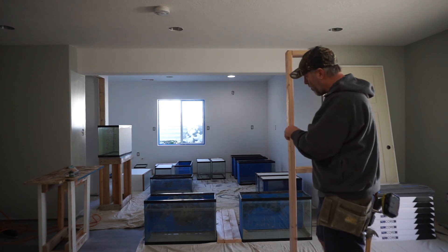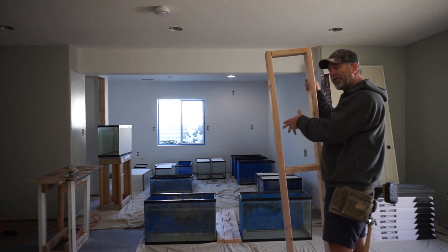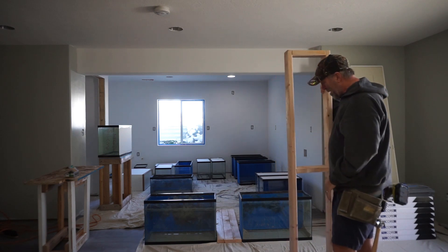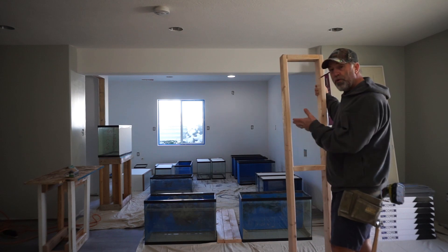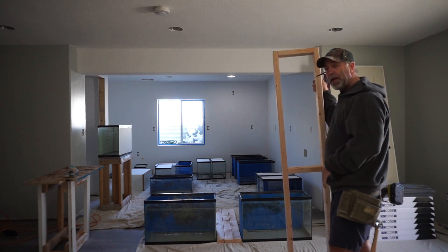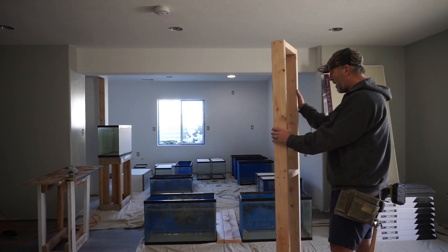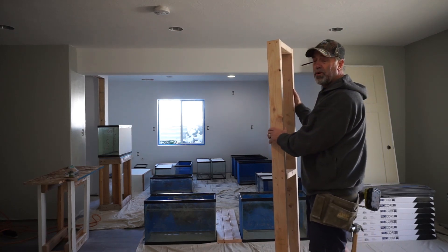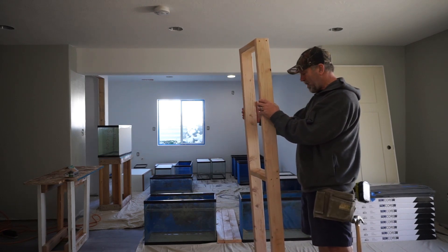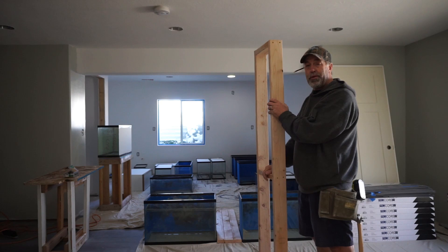You can see the tanks below here with those three boards in there. The middle board is needed because it's going to be over four feet — actually it's 5'5" or 5'6" is the actual rack. Because I'm going over four feet, I'm going to have to put center supports in so I don't get any bowing or cupping. It's very rare to get a bow or cup vertically. Four feet I'm comfortable without middle braces, but anything over that I like to add them.